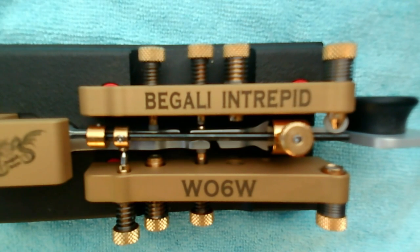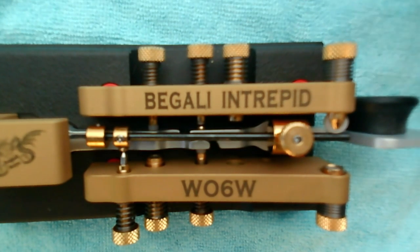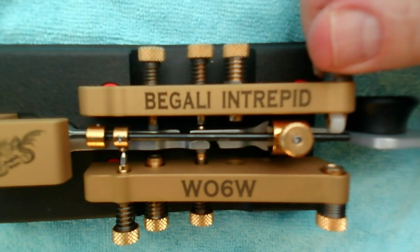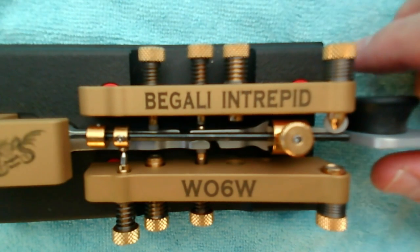We next set the dot damper with control R4. This little white nylon disk at the tip has some motion in it. As the dot pendulum is released from a string of dots, it will touch this wheel, and the wheel absorbs any residual energy in the arm. You'll notice the wheel is roughly parallel with the ground — the orientation doesn't matter. It's set so that the arm just comes to rest.